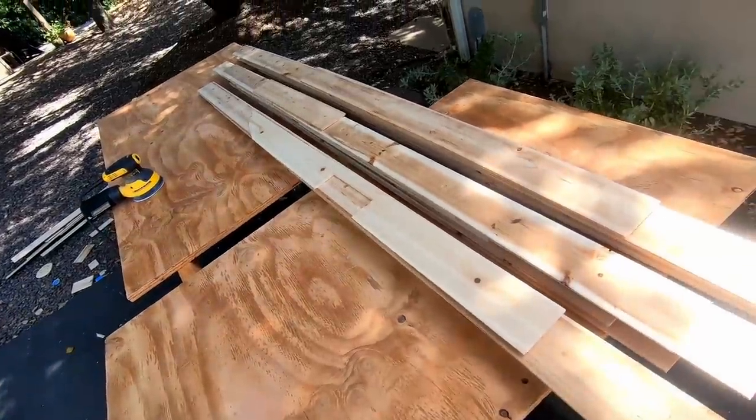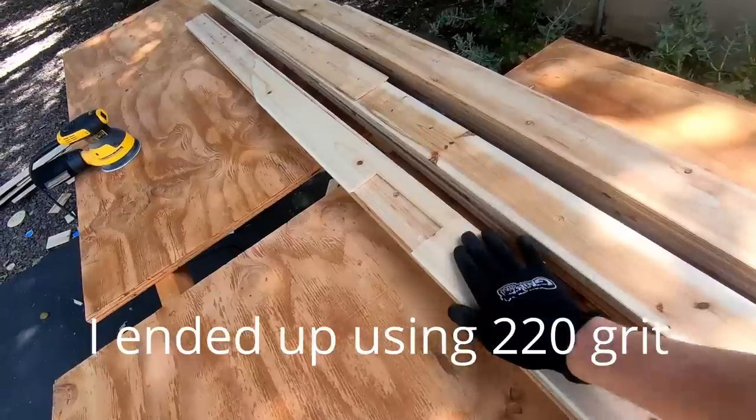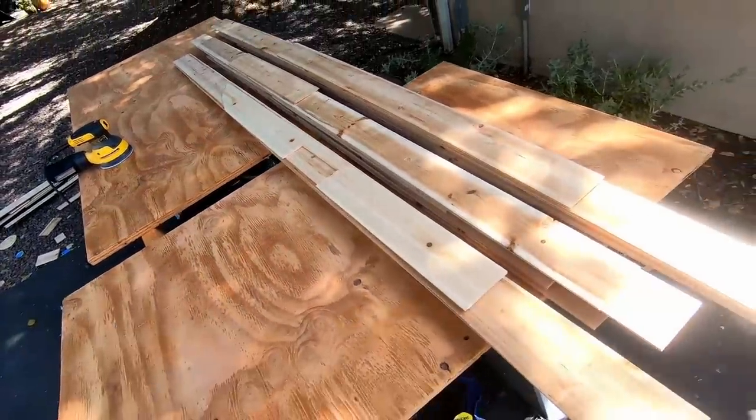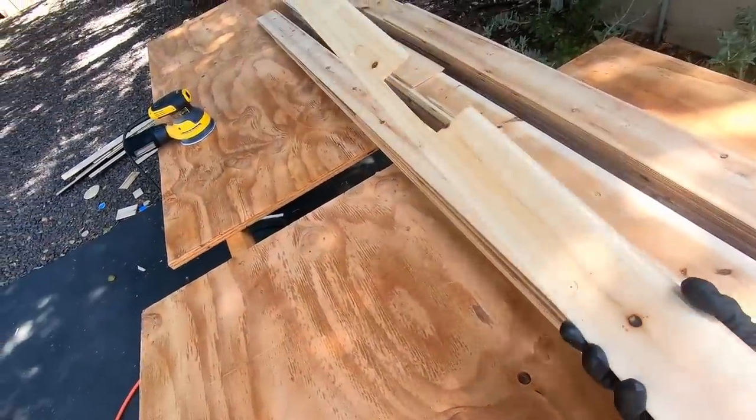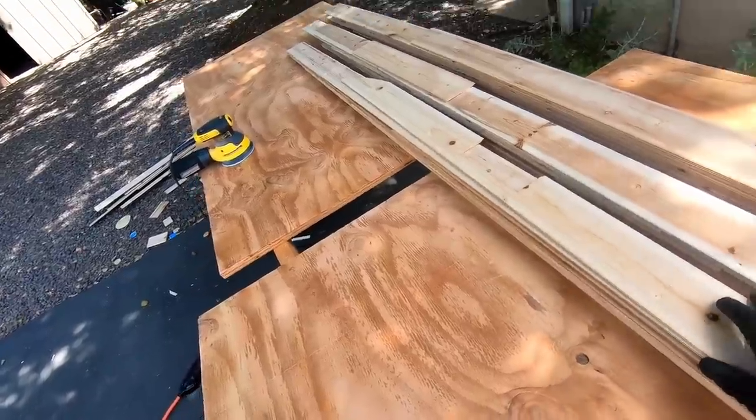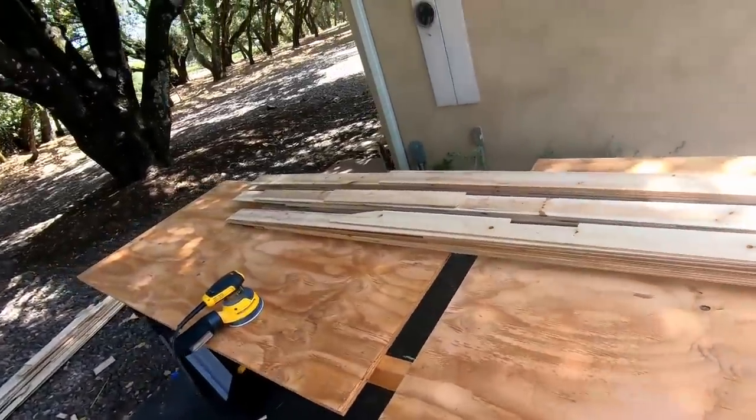The finished side is already finished pretty well from the factory, but I am going to go over it with 150 or 180 grit to get that nice final polish so it can soak up the stain really well. It's going to be quite a bit of sanding today, so I've got the headphones on and I'm going to be jamming out.